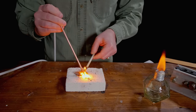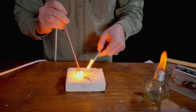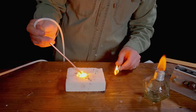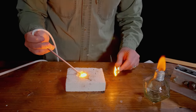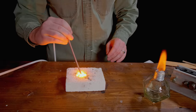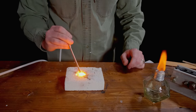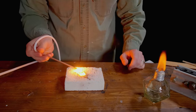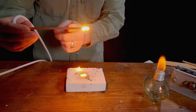You can see right away that this steel wool becomes very hot. And if I melt it into a puddle and then stick the end of this tube into it — it has sort of caught fire. I'm melting into this alumina fire brick pretty quickly. It's not quite as vigorous as my previous thermal lances, and I don't know how useful this would be to actually melt through any substantial piece of steel. But the steel tube itself is actually on fire, and you can see that flame is slowly creeping backwards toward the plastic tube.